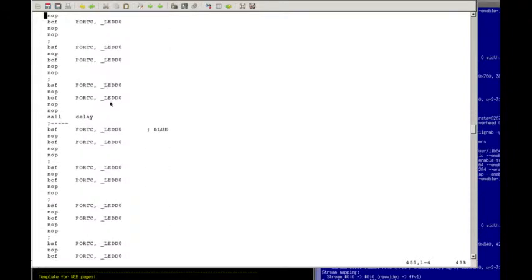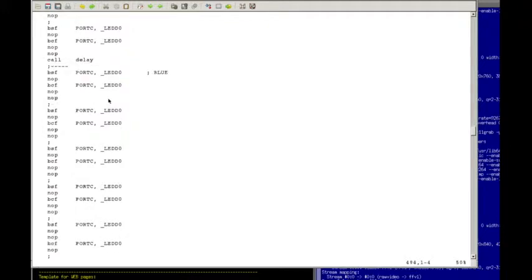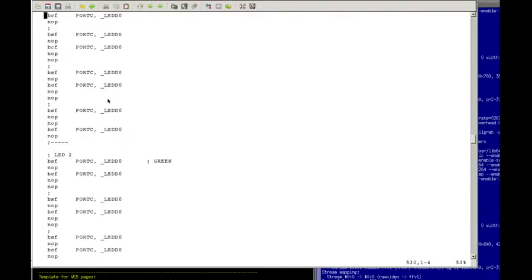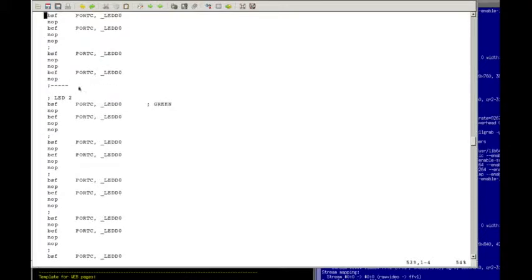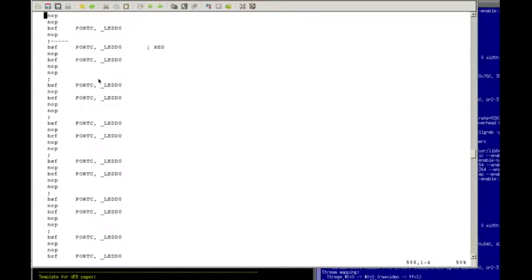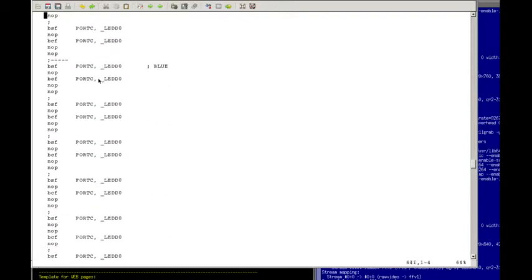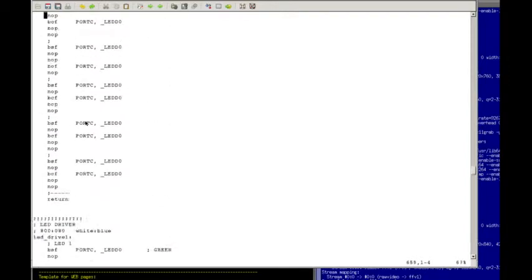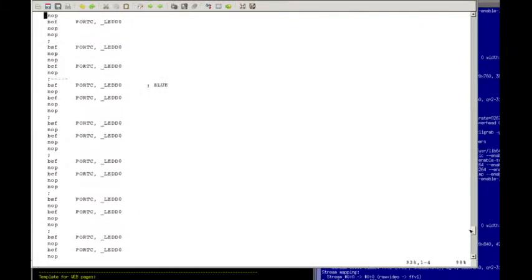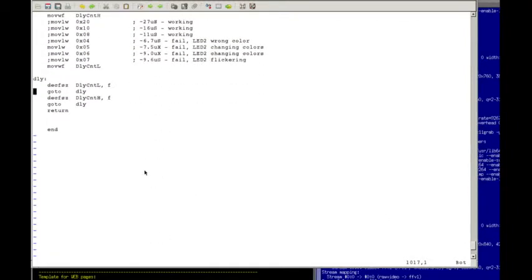And the reason I did this is because there's no computation time figuring out what bit to send, which LED we're on, which data bit we're doing, which color we're doing. It does that for 1 port, and it does it for the second LED that I have on the board. So there can be no timing problems introduced by driving the code this way. And the reason I did that is just to be able to tell where my anomalies are coming from when I alter the timing.